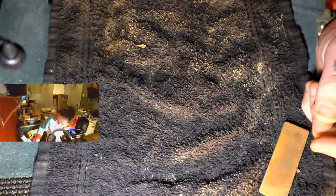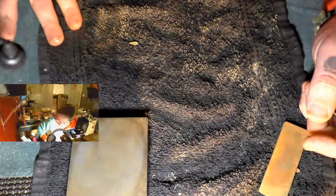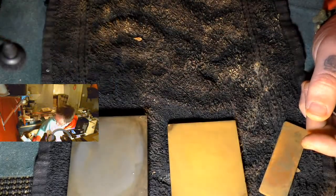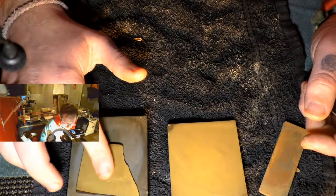No, you don't strop. I don't strop the blades. So I have that stone there, that diamond stone, is just for chips and things like that. Then I have this stone, which is an 800. This one, which is a finishing stone, which is maybe, I don't know, 3,000 maybe. And then I did have, it's broken half now, that is for the back side of the blade. So as I talk through the process as I go, and then I use this is Nagura. So this creates like a slurry on the surface of the stone.